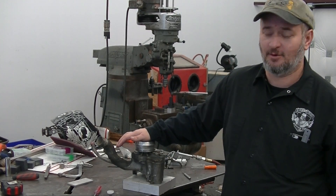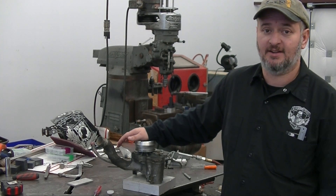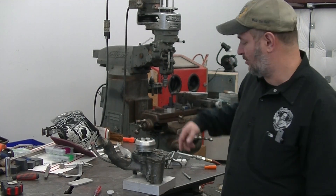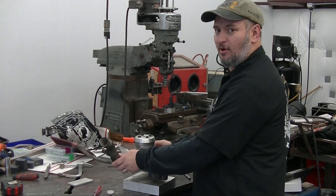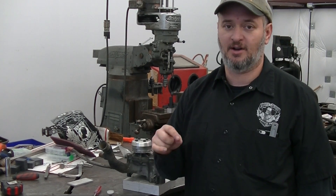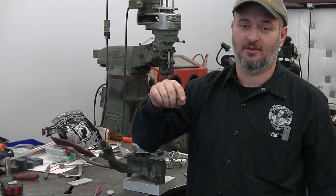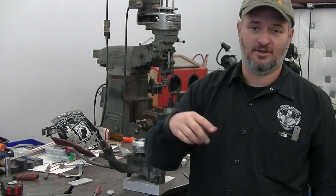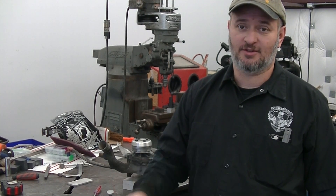The fixturing was pretty straightforward — it's got nice flat surfaces, just clamp it in place. It's almost like just basically drilling it out. Once we did that, I ran an M6 tap through it. I didn't get video of running the tap, but I cleaned up all three of the bolt holes. Now we've got nice clean threads. The one that was broken off still has a small piece of the original bolt in the bottom cavity. It's got a water jacket around it, so I couldn't go too deep. When I was milling it, the remnant broke free and screwed itself down into the relief for the threads — but there's plenty of room for the bolt to go in. You might need a slightly shorter bolt, but thread engagement is great and we're good to go.